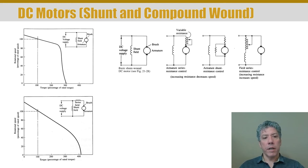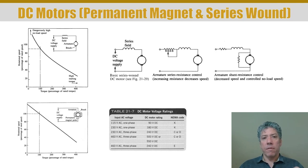You can see how the torque-speed curve varies — you get a benefit in added torque, but poor speed regulation. If we take it to the limit and have no shunt field, just a series field, these can be dangerous because at no load the motor speed can increase theoretically without limit. In reality, bearings do provide some load, but this can be very dangerous. This type of motor has very high starting torque, but it's kind of a double-edged sword. You can control the speed by putting resistances in various locations around the circuit.